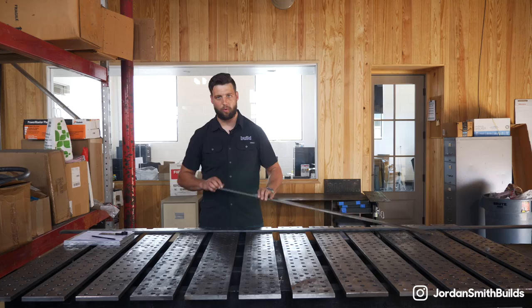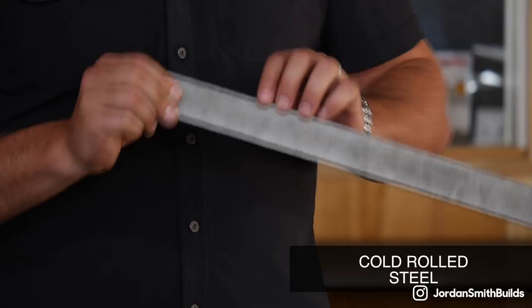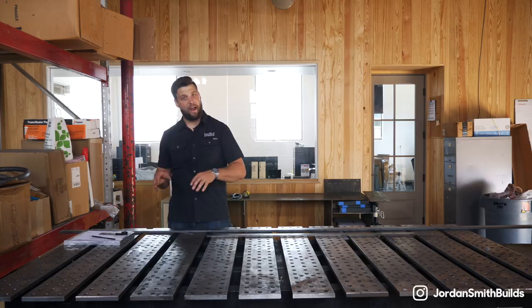The main difference between these two is cold rolled steel is rolled at near room temperature. The advantage of that is you get nice clean edges, really strong corners, and very straight geometries. So if you have something that is going to be a focal point of your design, and you're going to have people looking down a long stretch and you want it to be perfectly straight, cold rolled is definitely your way to go. For outdoor rails, it's cheaper to go with hot rolled steel.